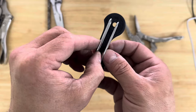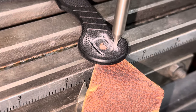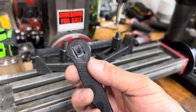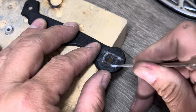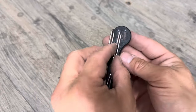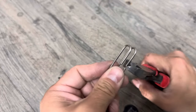We just need to trim it down and mill out this handle here. Here's my mini mill — I have a sixteenth-of-an-inch end mill in the machine. Looks decent enough. Now I'm using a little diamond file to put in a chamfer at the top to accommodate the curve of the clamp. Let's trim this thing down — this part is going to go in here, but not that part. I'm going to mark it right there and then file it into place.